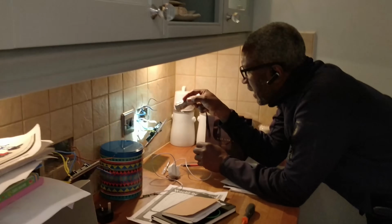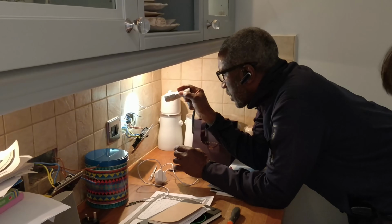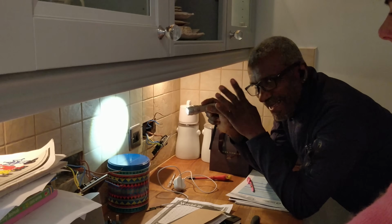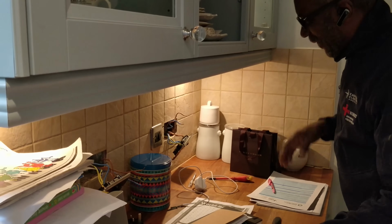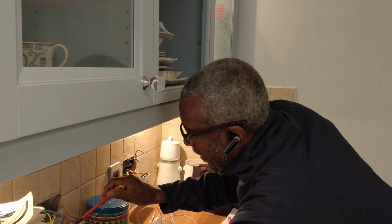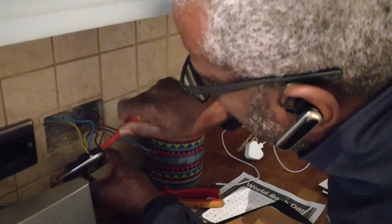Oh my gosh, see, you've got all rust here, terrible. Is it damp or something? Must be, but I don't think the rust is what's causing the damp. It's this, because there's a fault on that circuit. But like I said, let's not get too excited. Let me reconnect and see what happens. I think we've found it. Hands off, Ed. Right, let me switch off again. We've done this so many times, it's the same thing as you've seen me do before. I think we found the problem. So I'm just going to reconnect the circuit now, and I think the RCD should stay put. It's just the faulty garden lights that was causing it, it seems to me.